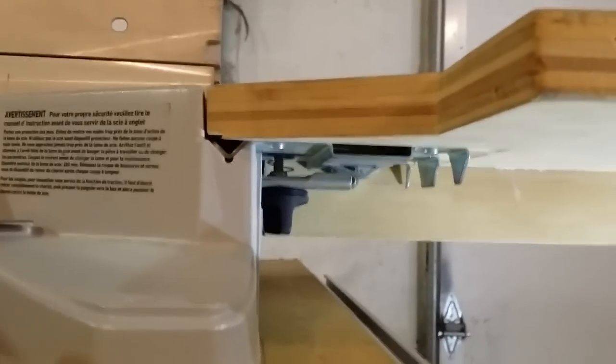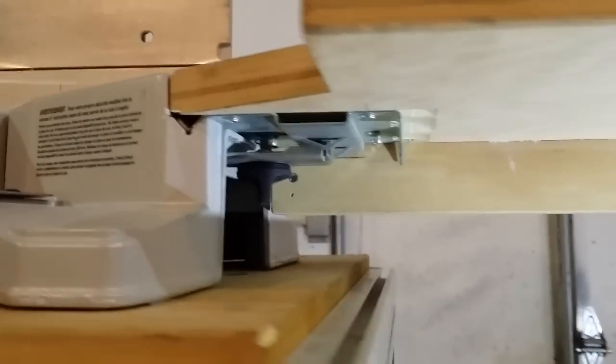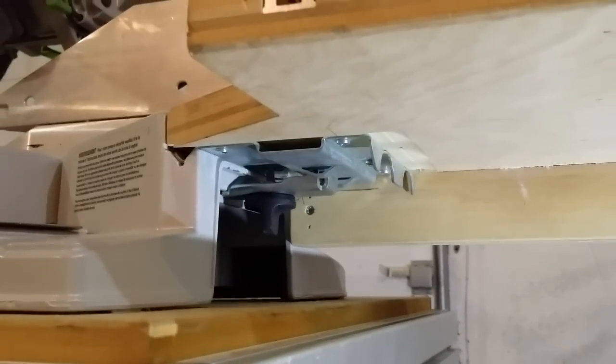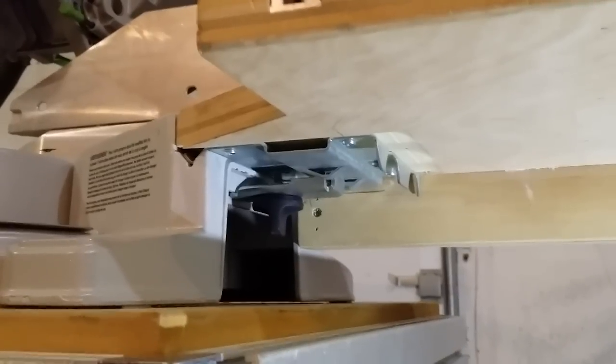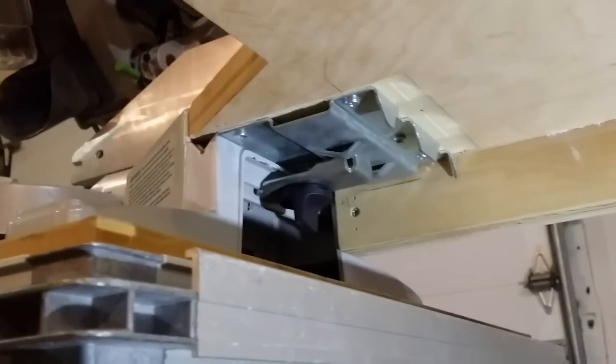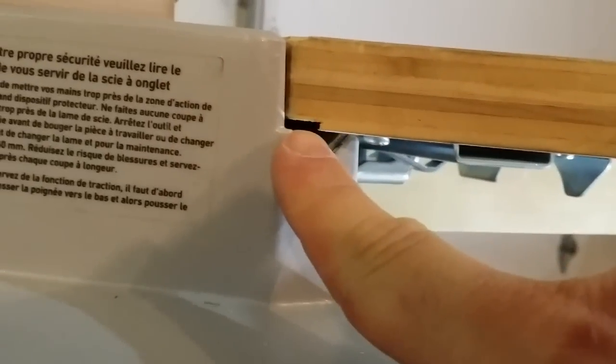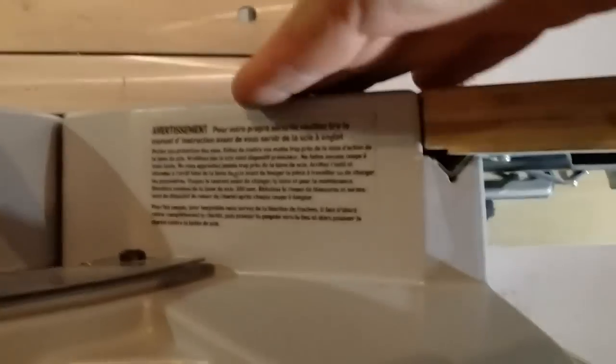All right, we're back. Taking a quick look at the bracket that attaches everything to the saw. This bracket was stolen. Well, it's not stolen. It's just the parts. There's Festool spare parts from the UG wings that Festool sells. I just ordered a couple of their parts off their ECAT online ordering system and put it all together. Because of the thickness I made this section here, I did need to route it out a little bit. You can see that's the dimension there that I had to route in, kind of mortise in a little bit in order to get the top surface to sit flush.